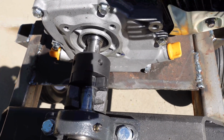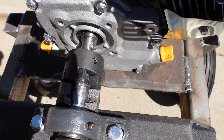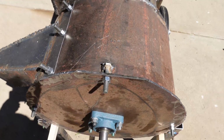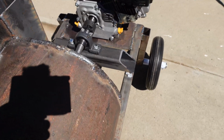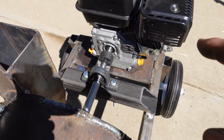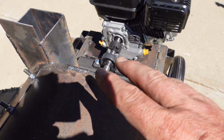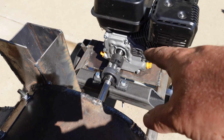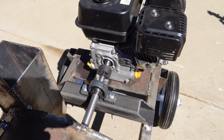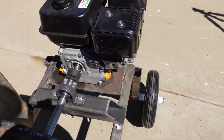And I think what happened is the engine was getting up to speed there a little bit. This thing has a terrible amount of flywheel capacity to it. And so I think when the engine sputtered there a little bit, when the choke was on, it just snapped that thing right off. This thing had momentum to it. The flywheel effect just made that snap. I don't know where those things are made. I got it from Surplus Center, so obviously that didn't last too long.